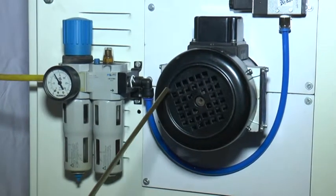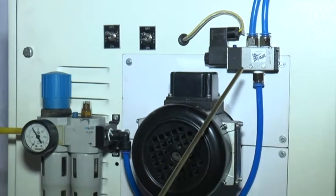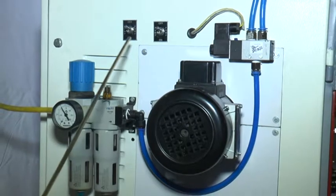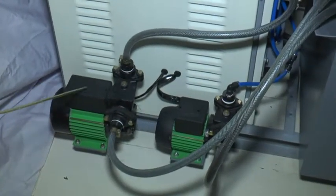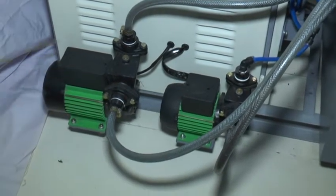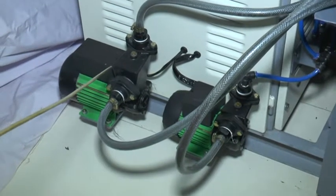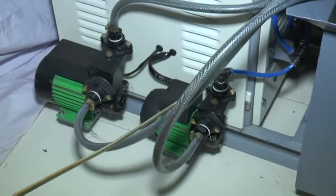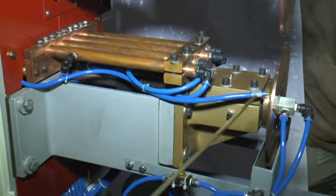This over here is a permanent magnet DC motor. This is a 5x2 single-phase 230 volt solenoid valve. These are 2 pump on/off switches for these 2 pumps here. This 1 HP pump circulates the water inside the secondary pipes and also the center shaft of this machine. Connect inlet and outlet of both the pumps inside this water tank — the tank should be at least 200 liters — for cooling the secondary wheels and secondary pipe properly, otherwise the welding will not take place properly.